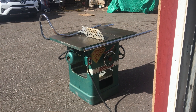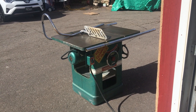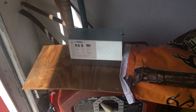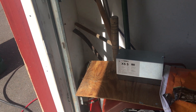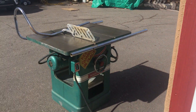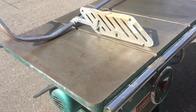This is a demonstration of a Powermatic model 66 table saw. It's got a three horsepower, three phase motor. I'm powering it through a Temco XS5 static phase converter, coming off single phase household power 220. This demonstrates that you can run this off a household 220 — you can give it a try here.